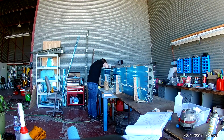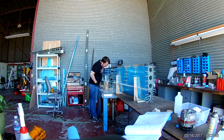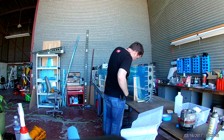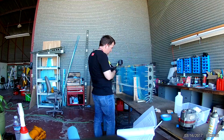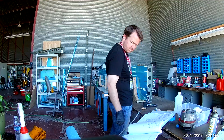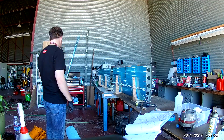The pop rivet gun doesn't swivel, so you basically only get to do it one way. The only way to actually get that done was to put the pop rivet into place, then slide the pop rivet gun — the main handle, the one that doesn't have the pivot point — through the bottom lightning hole. If you look at the end of the spar, you'll see there are three lightning holes in the top spar assembly. So the handle goes through the bottom hole, then you're able to squeeze ever so gently down, and then reposition and do it again. It is very difficult, but a little bit of practice and I got it done. Now that those are done, we'll start with the main ribs in the next video.